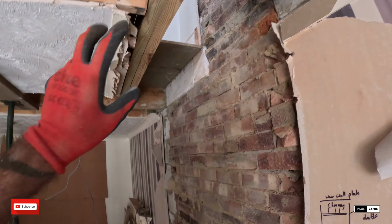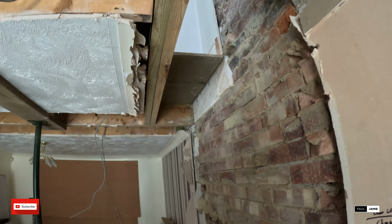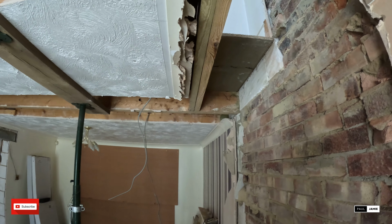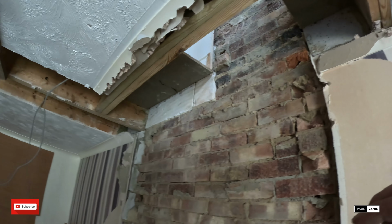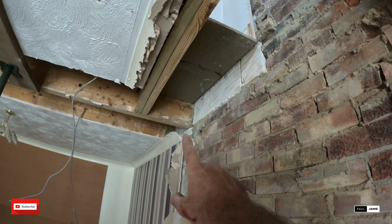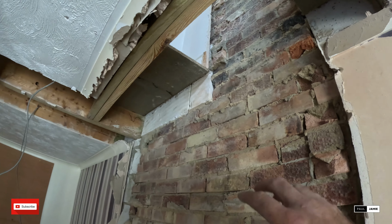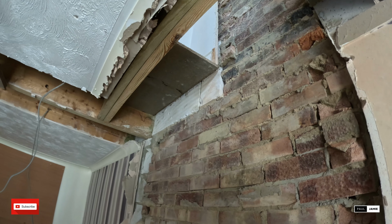We've got the double trimmer going through, which is picking up these joists now. Again, that's just been fired in till we get the jiffy hangers on. Sean's just cutting the timber for the wall plate, so we've gone tight from that joist to this one. Hopefully I can nail at either end, and then we can drill and fix the chem bolt. So that's our next task.